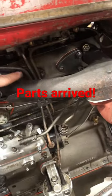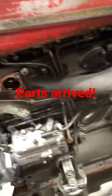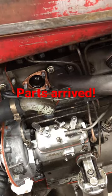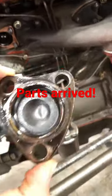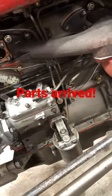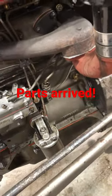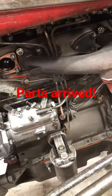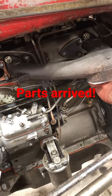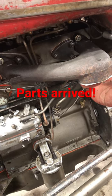We'll have to take the exhaust manifold and the three injector lines off to get to all three caps and replace them, because the old ones are missing something. I believe that was lost when the head was machined at the machine shop. These are missing a round piece that's supposed to fill the gap, so there's less compression — and that could potentially be why my tractor is not running smooth and not starting well. After that we'll get it started and give you an update.